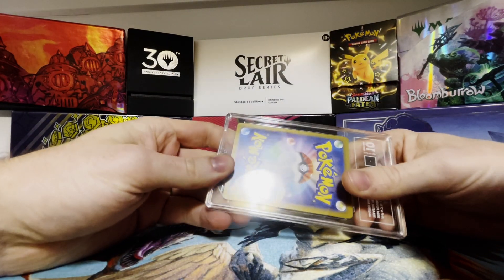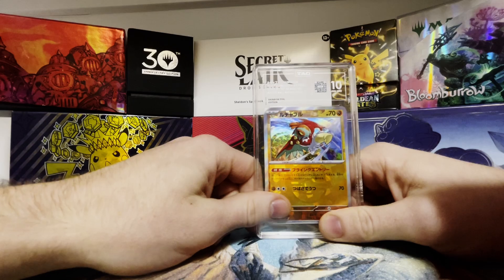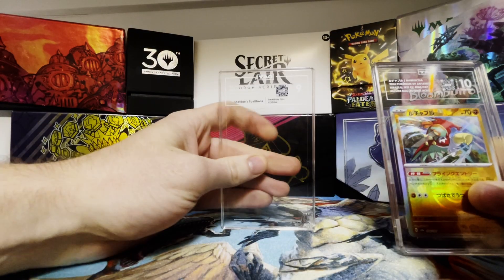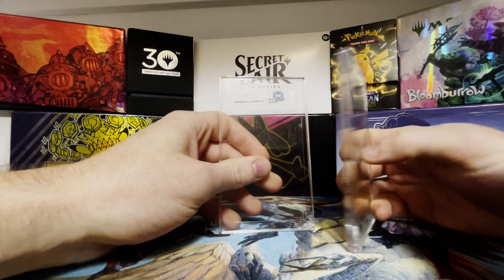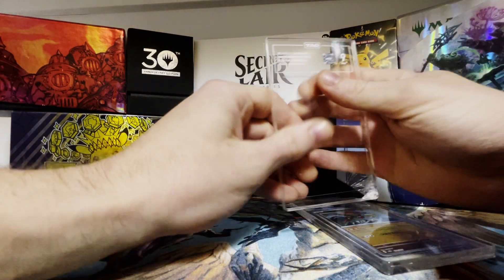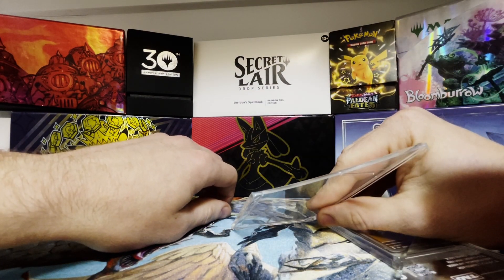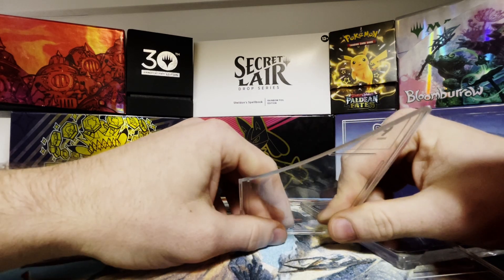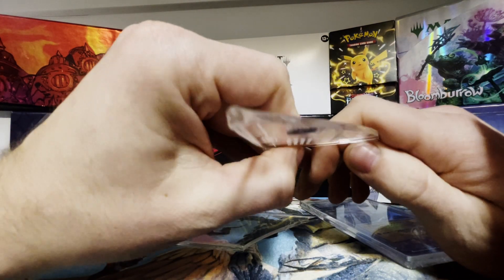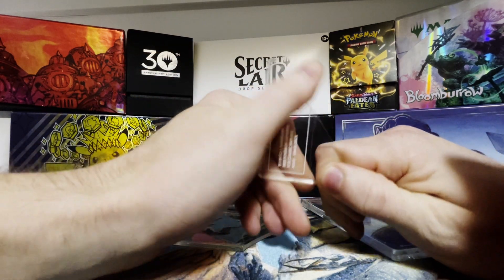After cracking this one a little bit, looking around and testing it — once all those welds are broken, you essentially have the front plate and the back plate. And if you break them all well enough, you'll be able to separate them. One plate is not as strong as two plates bonded together. So then, what you can do is just crack it with your thumb. Any single slab you have — if you have just one plate of plastic — you're going to be able to do that. And it looks like the crack actually did start on one of those weld joints, at the end of one of those weld spots. So that's further evidence to my theory.